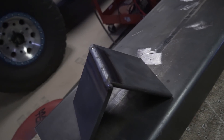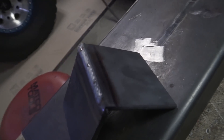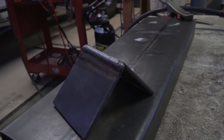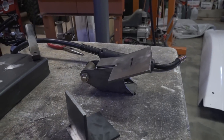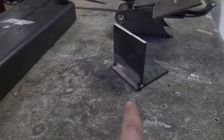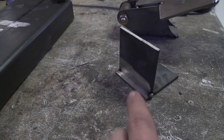With the plates butted up like that there's quite a bit of heat going into everything. It didn't come out looking too bad, but there's definitely not as much penetration as either of the other setups. Now we'll get the T-joint burned in next and you'll see the difference in how the weld actually lays down inside and looks a lot more profiled.